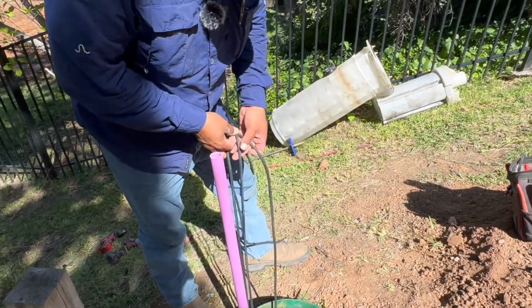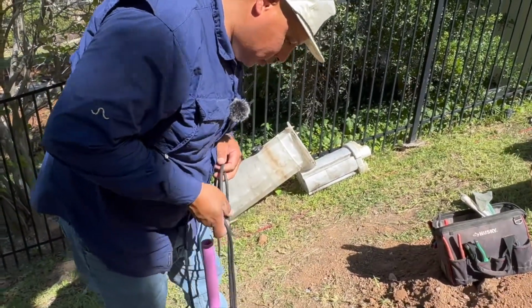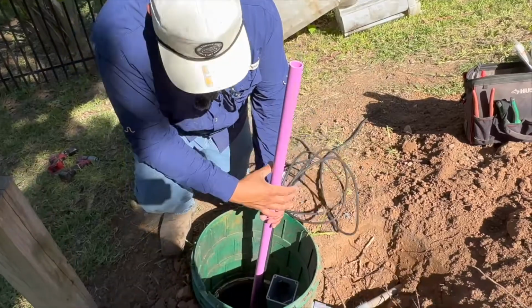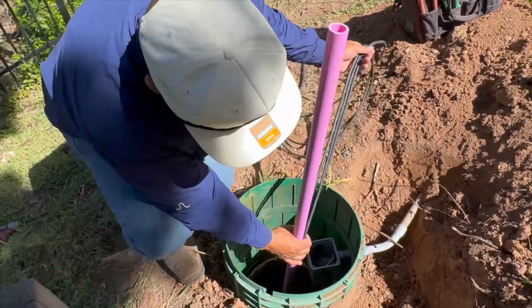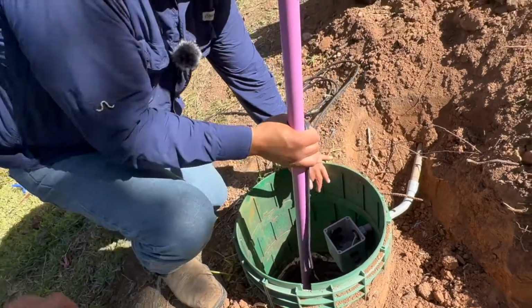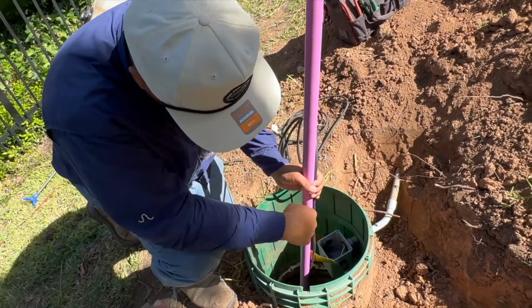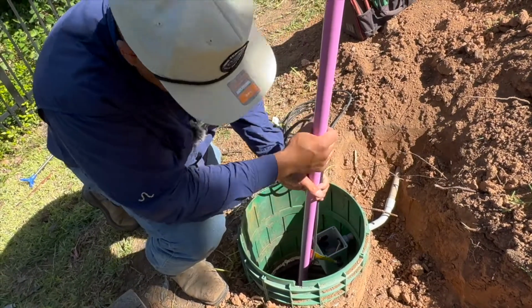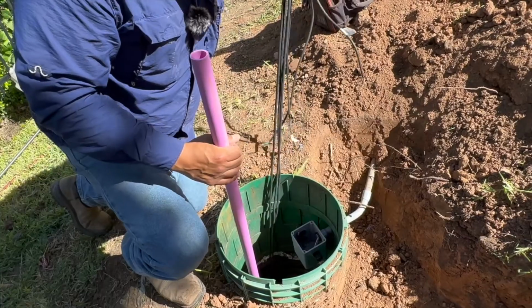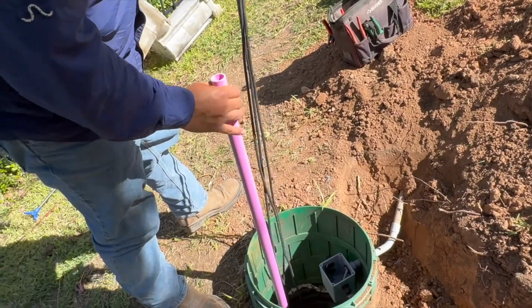And then no matter your tank depth, some pump tanks are really deep, some are really shallow, no matter what, you don't want to tape your wires to the point where, when you come back to take the pump out, I'm sure you've pulled out pumps before, they tape it here, and they don't give you enough slack, so as you're going, the pump stops there. So you're having to hold the pump, get your knife, cut off the electrical tape, or if it's got the stainless steel hose clamp, you got to unscrew that. Kind of go as you go. Well, as you can see, we got plenty of wire. So I'm going to leave my pump down there for now.